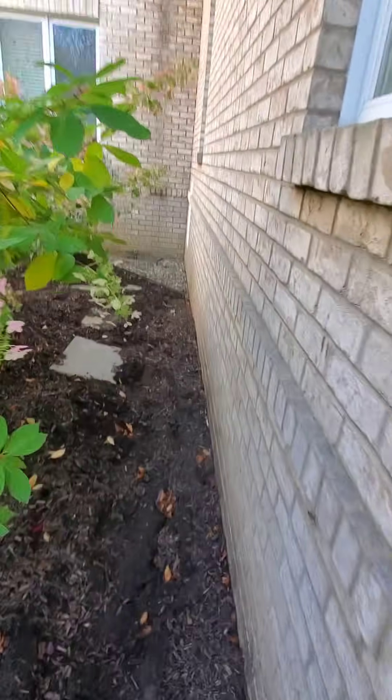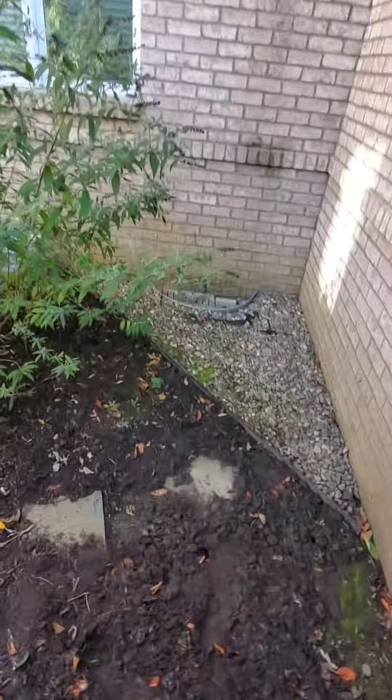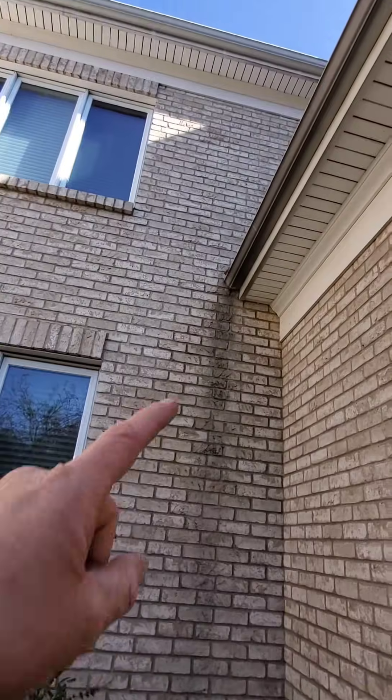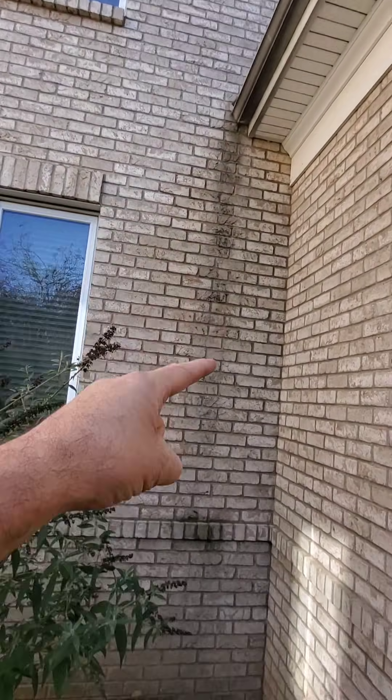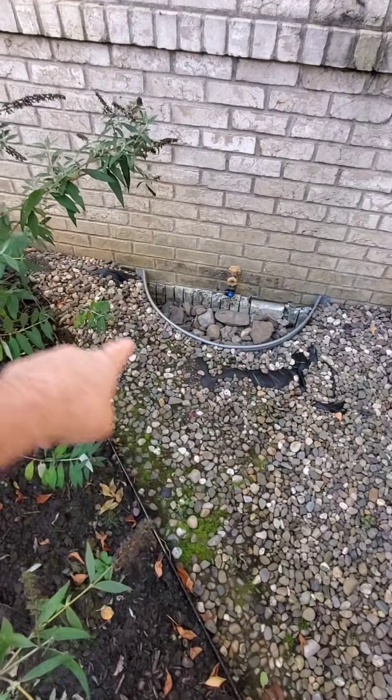The first thing that my son Austin and I noticed was this landscaped area has a center hump — it's all raised up right here, and literally everything flows down towards the house. Walking over here, I can see a whole bunch of causation factors. What do we see right here? A bunch of water just running right down this wall, and right below that is a window well.